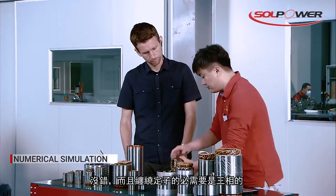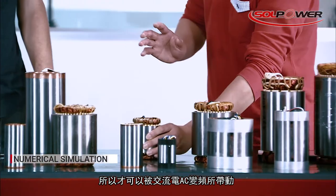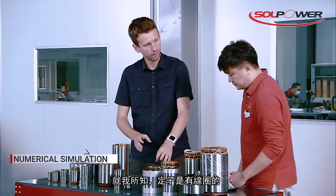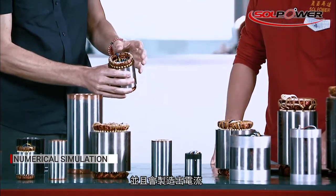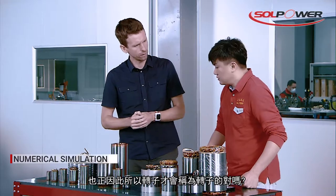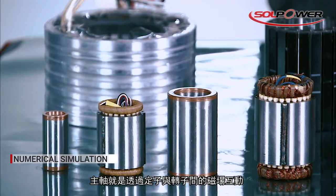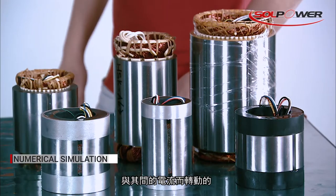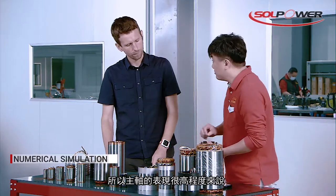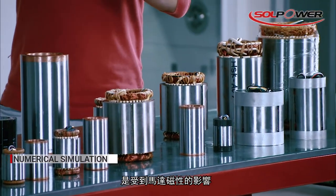The winding type of the stator should be three-phase, and they can only be powered by AC inverters. You mentioned we have a stator and a rotor — from my understanding, the stator with the coil creates an electric current and this current causes the rotor to rotate. That's basically right. A spindle operates through the interaction between the stator and the rotor by the magnetic field and electric current inside the coil. So the cutting performance is heavily influenced by the mechanical characteristics inside the motor elements.